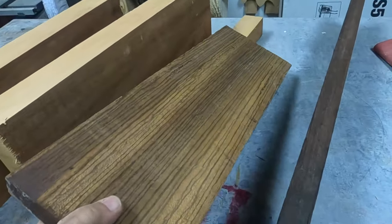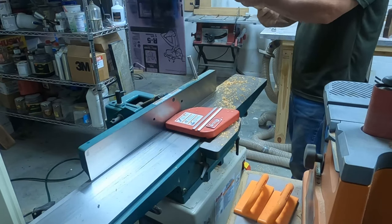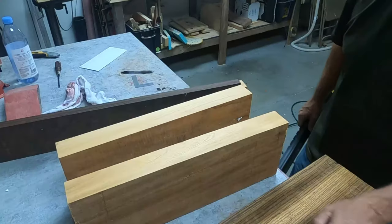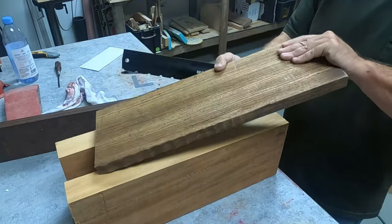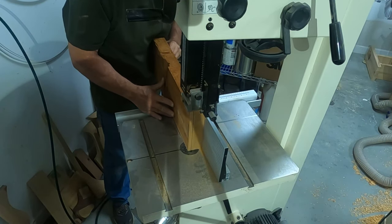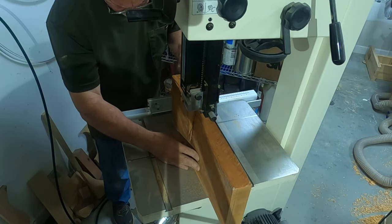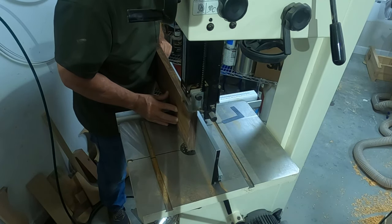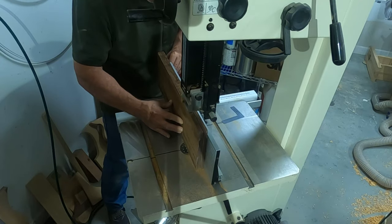Here's a few clips of the wood I selected for this guitar build. These are the pieces I'm going to join and mill up — that's the neck piece. I run it through the joiner, squaring everything up before I rip it down. There's my top — it's a four-quarter piece of zebrawood. I'm just checking the flatness so I can go ahead and plane it. Here's the body — I'm cutting it down to the proper thickness. The pieces I cut off I'll use for the control cavity cover.